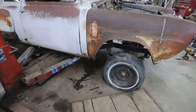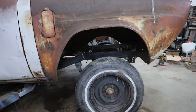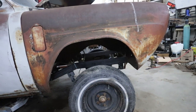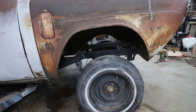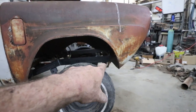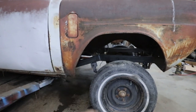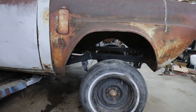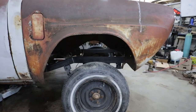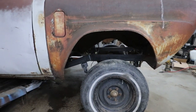Well, I guess it's as far as I'm getting tonight. It's sort of like a roller now. The springs are not set up right at all. Because they're a trailer setup, I don't dig it, so I'm going to build some. The front mounts are okay. The backs, I'm going to build a bushing or something in there. It's kind of a weird setup. I'm just going to do a bolt, whatever. I'm going to make a bushing anyway.